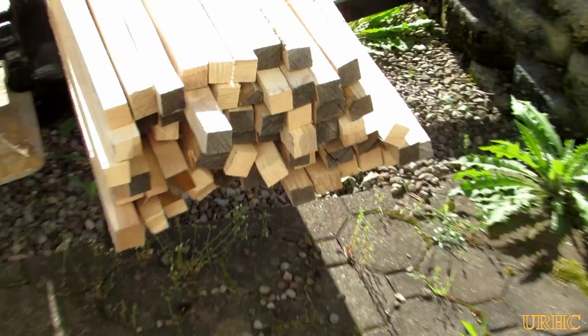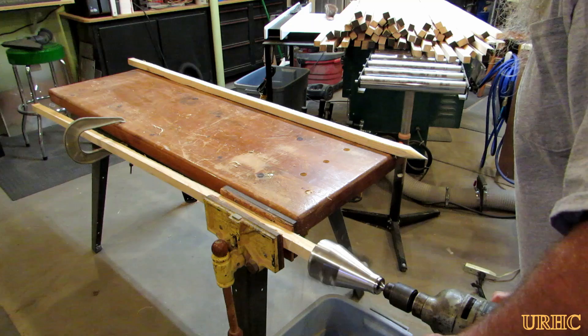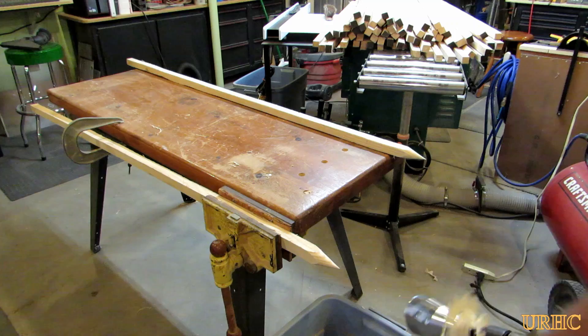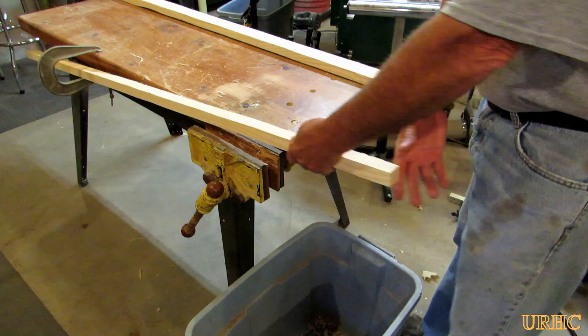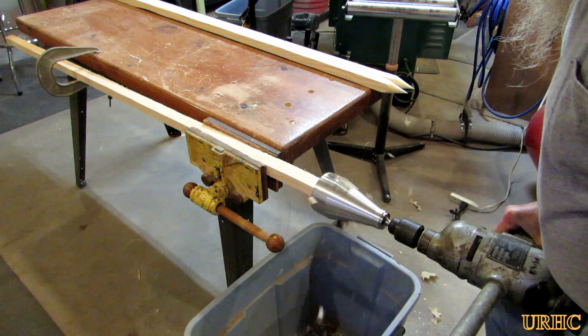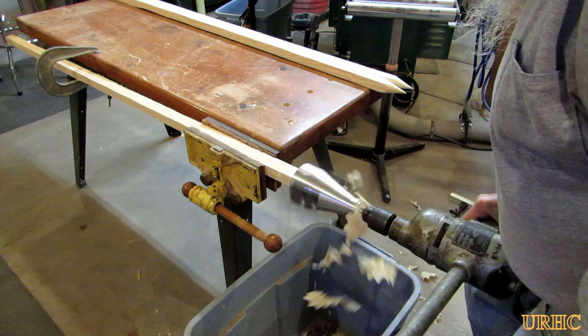I released the tension on the blade - you don't want to leave the tension on the mill when you store it - and folded it up. Now I'm moving these blanks to my workshop, starting with the inch-and-a-quarter ones first. I've got the Lumberjack stake pointer set up with the thicker washers to start out with to give it a little bit finer cut. I'm noticing that using this fresh-cut wet wood, the thing cuts about six times as fast - it just cuts like butter. It cuts clean and doesn't really tear it out or anything, so it's really a lot easier job than I thought when doing them fresh cut and wet.